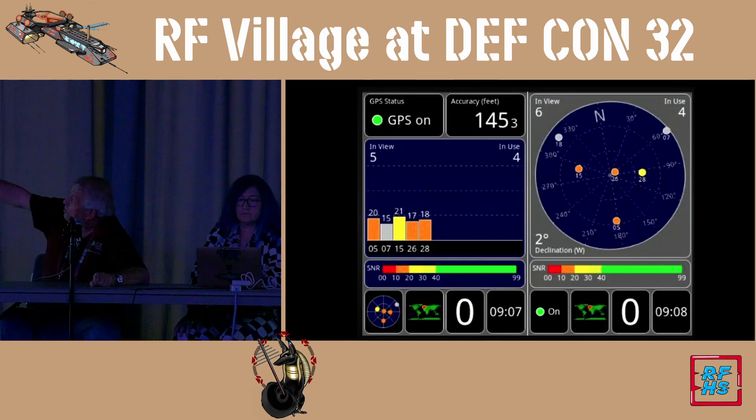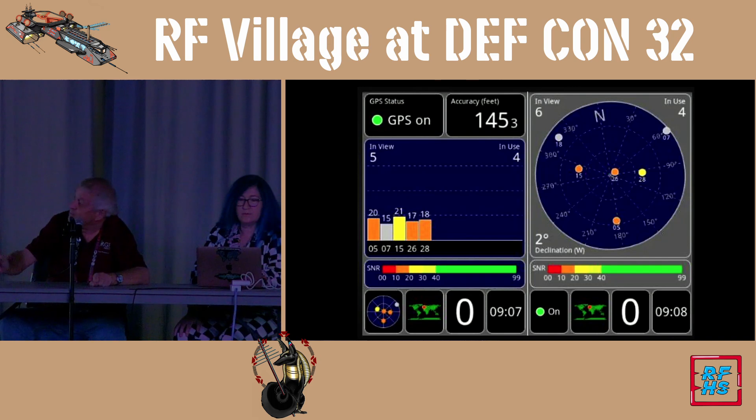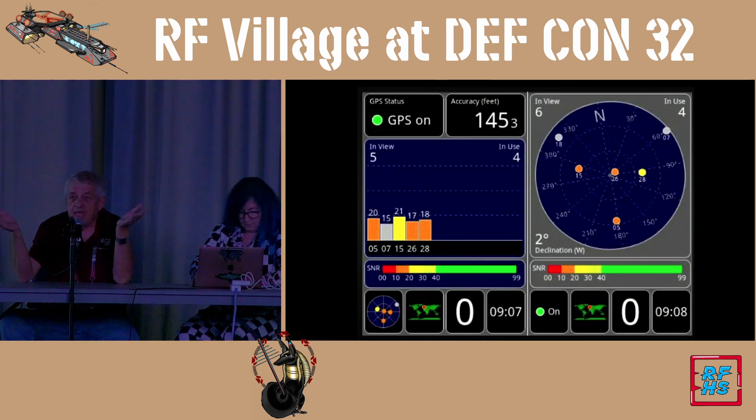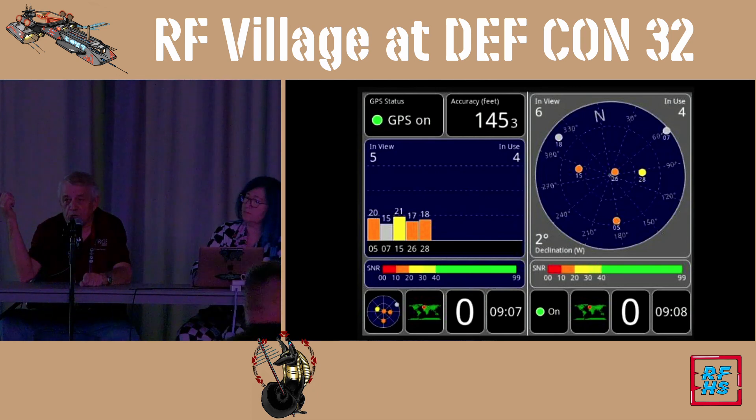The ground plane means you're losing the satellites near the edge, but you're still getting all the middle ones. Now, if you can get to the GPS information itself, you're normally picking up half a dozen, maybe eight satellites. But suddenly you're going to have two or three which are a hundred times stronger. If you've got any smarts in your GPS system, you ask: where did these signals a hundred times stronger come from? Be very suspicious that you're being spoofed.